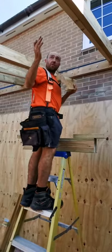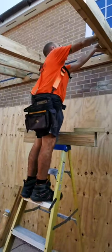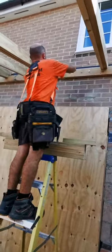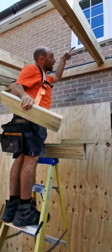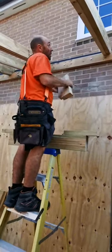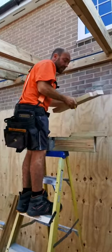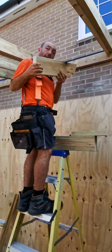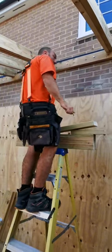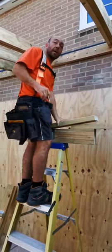Veluxes - once I've got my centre or my point of my Veluxes, I like to cut the top in first. What I do is I mark it either side and those are my lines to go to. I can put two nails either side and hold my timber against it, get the nails started - it just makes it easier. Instead of getting to a point where you cut it too big or too small, you've got a pattern. And if there's a load of them, I do one end and the other end, ping a line and double check for any discrepancies. Usually the pattern works fine.